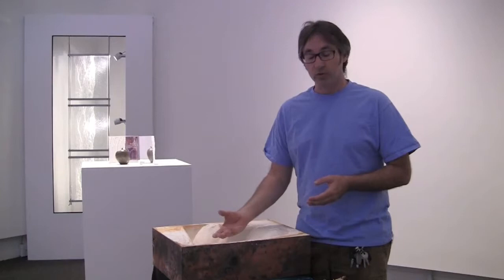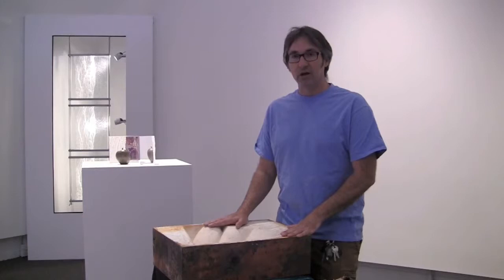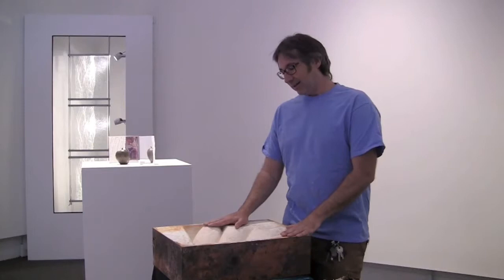Once the glass is melted down, I lower the temperature from 1500 degrees to about 830 degrees — that's the temperature where the glass becomes hard. After that point, I have to be very careful about how quickly I cool it. As things cool down they get smaller, and if I cool the top of the glass faster than the inside, it'll shrink and crack. To prevent that, it goes through an annealing process where we cool the glass from 830 degrees down to room temperature. For a piece this size that takes 7 to 10 days. Larger pieces can take much longer — in fact, there's a story of a telescope lens that Corning made that took over a year to cool down. Luckily, I'm not dealing with anything on that scale.